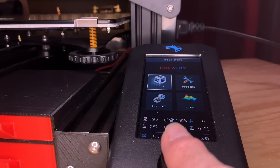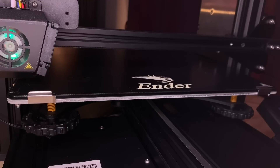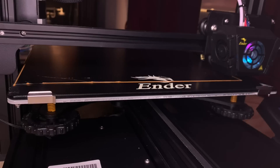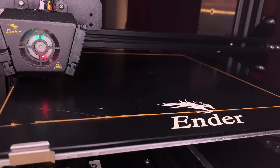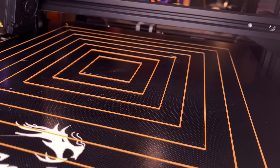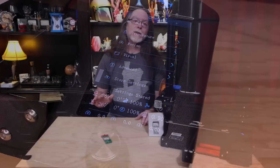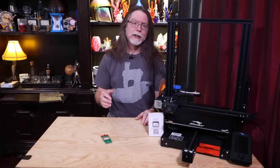To test your results, print the squares test file. If you need to, adjust your Z offset up or down a little bit so the filament is sticking to the bed and it isn't squished too much and the squares look just right. On mine, I needed to set the Z offset to 0.2 millimeters and then things look perfect. If your printer's firmware allows you to adjust the Z offset value, I think that will help ensure success. Save your settings on the printer so it'll remember that value. If your printer doesn't let you adjust the Z offset, you can still fine-tune during the squares test by adjusting the knobs.